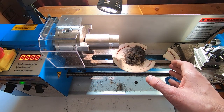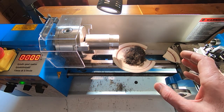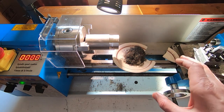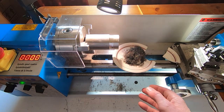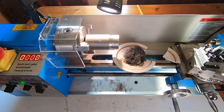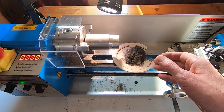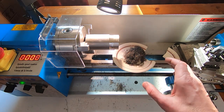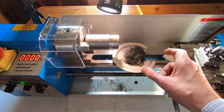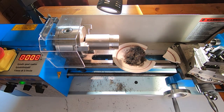You can see how much heat this generates — it was enough to break the plate it was sitting on. I was about a metre away and I could feel the heat coming off this. Now, if that had been a big pile of swarf underneath the bed of the lathe, that could very easily do a huge amount of damage to the lathe, and with all the oil and grease you normally get on a lathe, that could have done an awful lot of damage. It is almost impossible, once it gets going, to put it out, and it does take off very quickly. This was just a tiny bit of swarf, and you can see it was easily enough heat to destroy this plate.